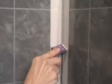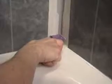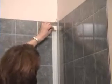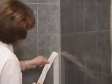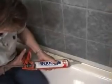The Barker caulking tool held at this angle will leave a maximum bead of silicone and at this angle a minimum bead. Now, isn't that easier than moldings and looks better too? Especially the top and bottom corners, which are not only attractive but much better sealed against water than plastic. Oh yeah, you've done this before. No, it's really that simple.